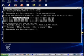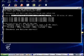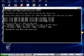Back to our ping. At its most basic level, Ping is a tool used to troubleshoot network connectivity. For example, number 1, you can learn the IP address of your target, as seen here. If you don't get this first line, that could indicate name resolution problems or problems with your server perhaps talking to your DNS servers. Number 3, you can see the amount of time in milliseconds that the entire round trip takes, and you can see that for each individual echo request and echo reply. Finally, Ping concludes by presenting you with some statistics about packet loss and round trip times.